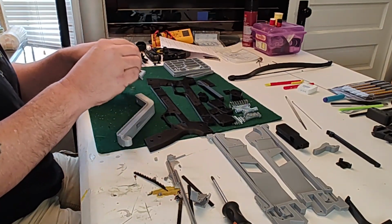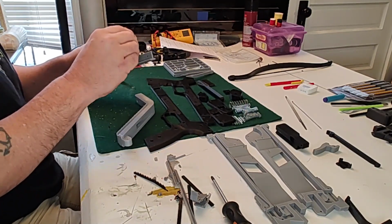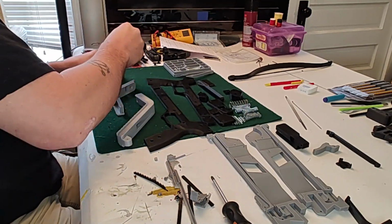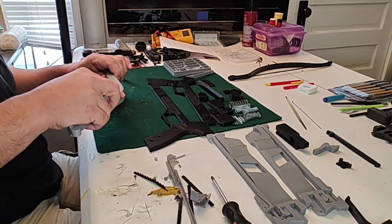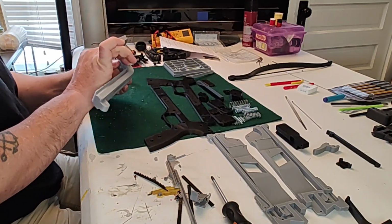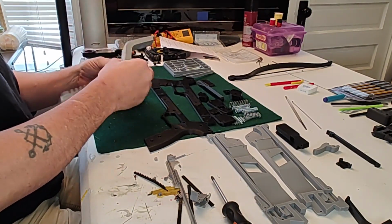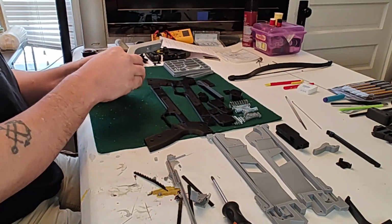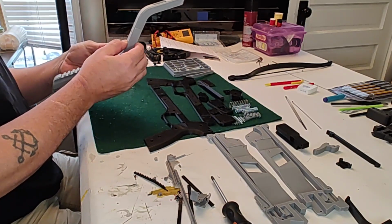The pistol body parts are actually 3 pieces. Put the side front and side rear parts together, then add the pistol body covers, which are both glued and screwed. The crank arm also gets bolted after gluing. The body and the magazine parts are mirrored or handed, depending on which terminology you prefer. So you have to make sure that you have all the left and the right side parts identified before starting your assembly.